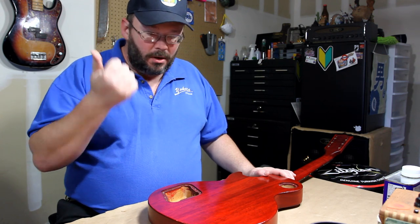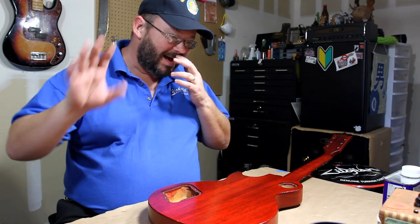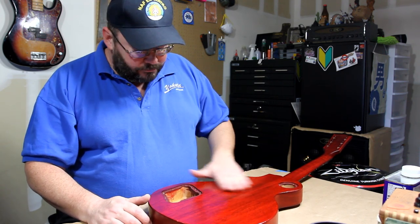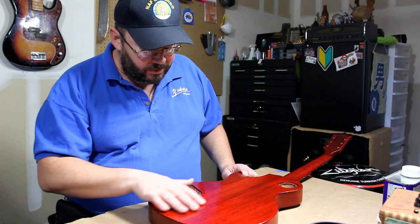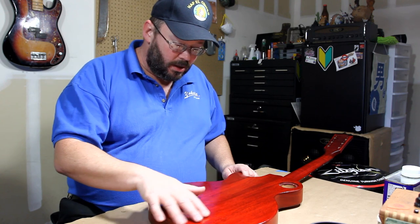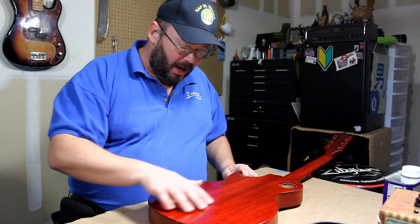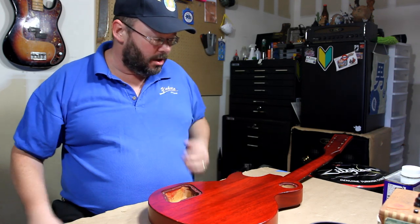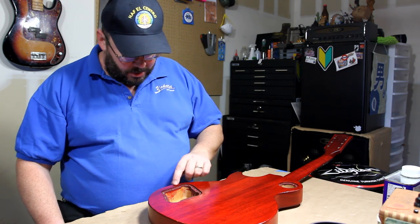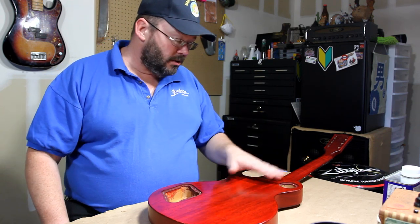So today we're gonna open the garage door, set the sanding station up kind of next to the door, try to keep as much dust out of here as I can. We're gonna sand this down, try to get most of it off, and hopefully what we'll see when we're done is most of this will be gone, and you'll just see little spots where the Z-Poxy has filled the grain. We're also going to see indentations, because I can see already there's some areas that really didn't take it. So we'll put as many coats on here as we have to get it flat, and then we'll move on